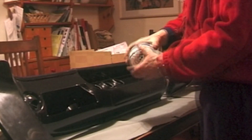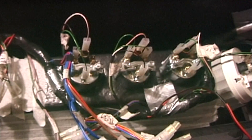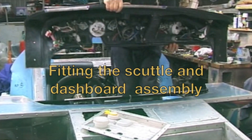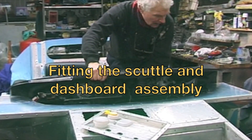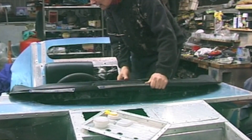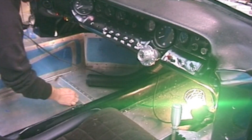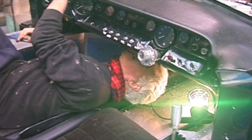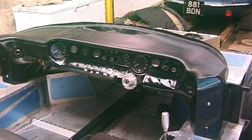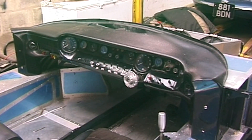I'm having to do this because the wiper motor is not in the same place as Mick has got it. I'm going to start fitting some of the dials - I've now laid the harness in and I'm debating whether to run the main harness along the top instead of diving it down underneath these instruments. That dashboard is now in with all the connectors connected up to the front and the aircon hose is connected up as well.